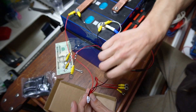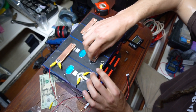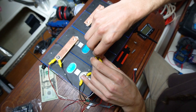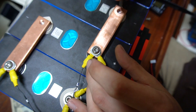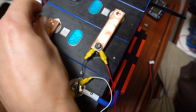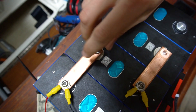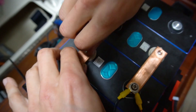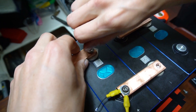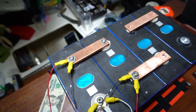The sensing wire and the negative are done. The next wire goes to the positive of cell number two. These screws are honestly not great — there are only a few threads when you have the bus bars on, and without the bus bars they're too long, so I'll definitely be replacing them. For now, for testing purposes it's going to work. I'll also put the negative screw on because there's nothing that goes on the negative of cell two. Just going to loosen this and give myself a little wiggle room — hand tight, it'll work.